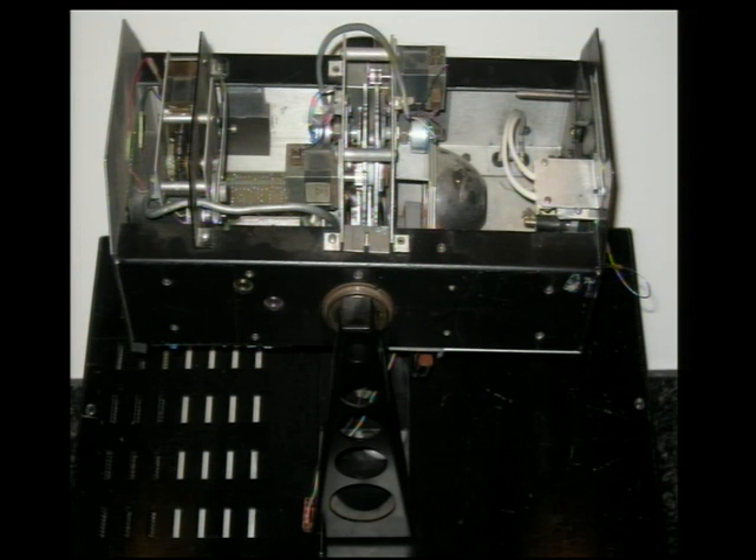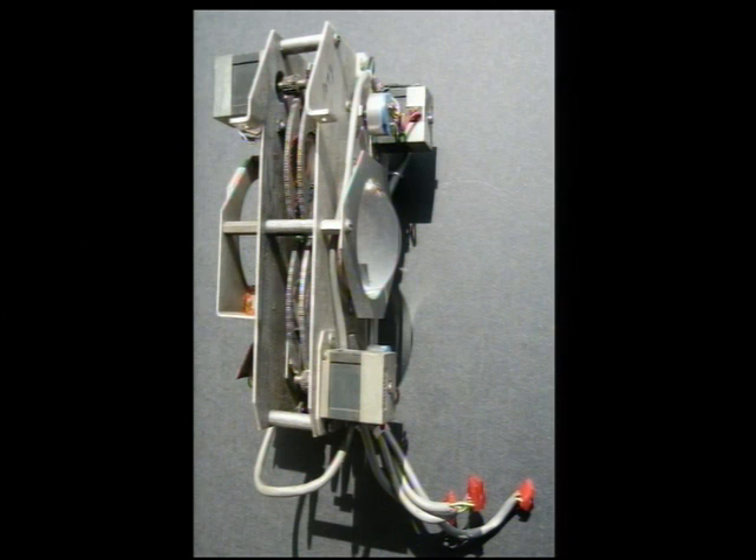We had a source — and this is a good look at the inside of a VL-1, the source over there on the right; actually there's no lamp in this one. We put some wheels in the middle, and then there was this aspheric lens that went on the front of it, and we had an iris in the front that controlled the intensity. That's not much different than the system that we use today.